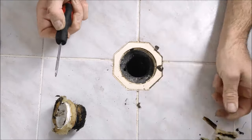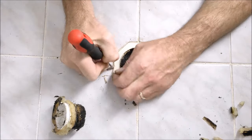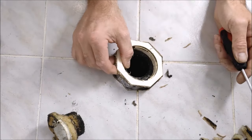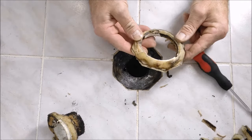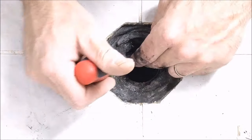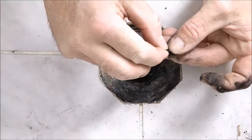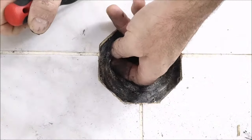Removing all the silicone from around the drain — that silicone had not adhered to the mortar, it was a failed attempt that someone had done at one point. We'll remove the shower waste base. The membrane is a rubbery, bitumen-based sealing compound and it's not intact; the integrity of it is lost and it's left gaps around that pipe.